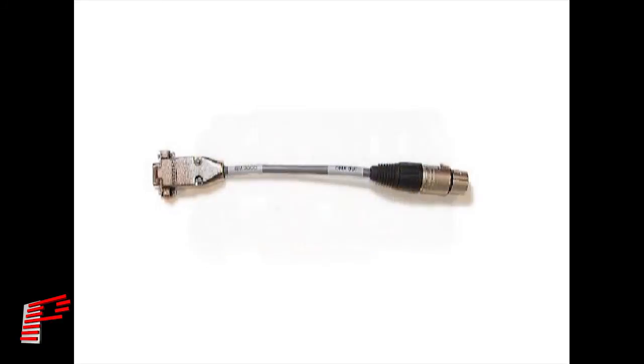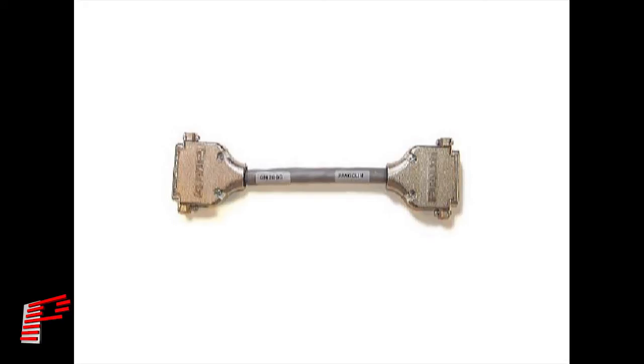You'll see an adapter cable that adapts the QM2000's DB15 connector to a 5-pin XLR connector for DMX output. Your LD2000 box may also contain a QM2000 to Pangolin DB25 adapter cable. This cable may be used to adapt the current QM2000 output to Pangolin's older DB25 standard, used on the Quad Mod 16 and Quad Mod 32 products.